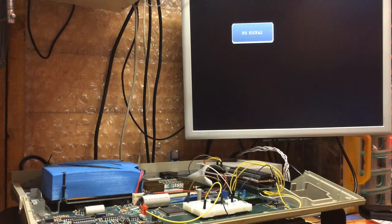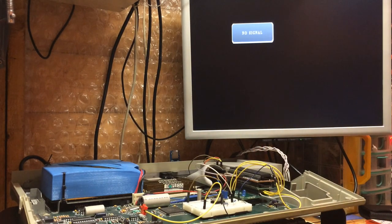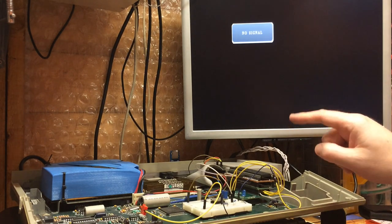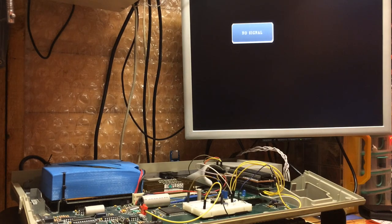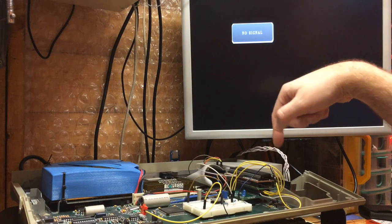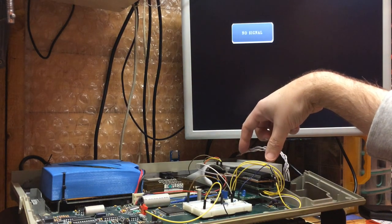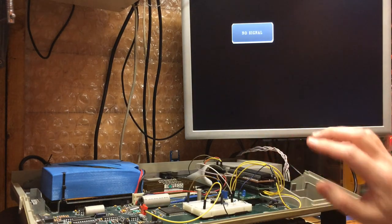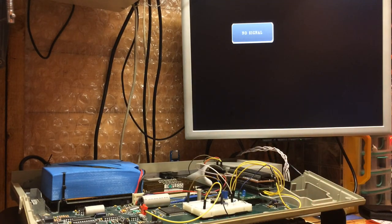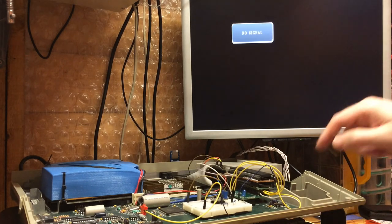Hello again, it's David. Today I'm just going to put a bit of a tin lid on this prototype Atari ST 16 megahertz plus AltRAM booster that I built a video or two ago. This is still completely prototype form because, if you remember, I got my form factor wrong for the 68000 socket, so there's all sorts of adapter boards going on here and a load of hacked mess, but this was only really the first iteration. I hope to be able to spin another board.